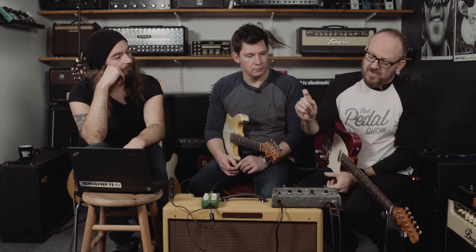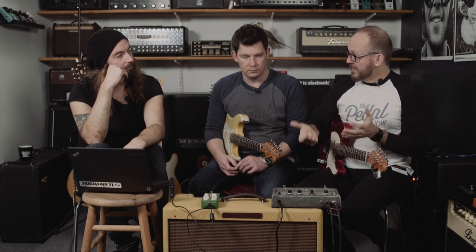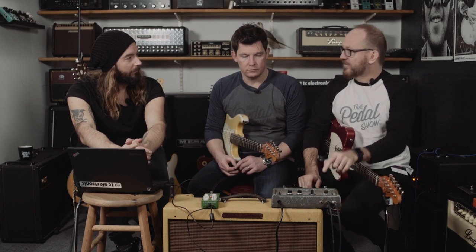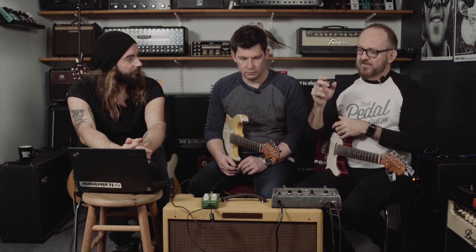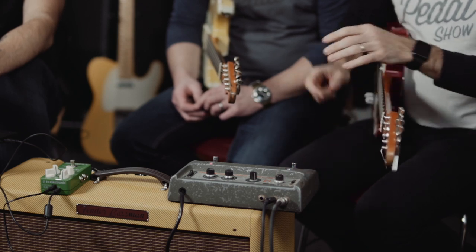For anyone that doesn't know, this is Boss's first pedal, but it wasn't designed for guitars, it was designed for keyboards. The level control is basically an input gain attenuator, and it happens right at the input. And that was a 50K pot. So normally the output of a keyboard has a much lower output impedance and would easily drive that, but a guitar has a much higher output impedance. And if you plug the guitar directly into this originally, it would be very dull.